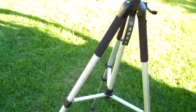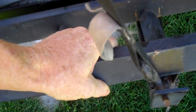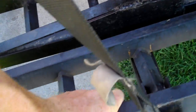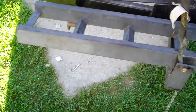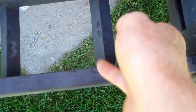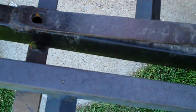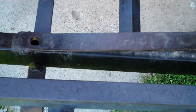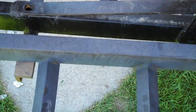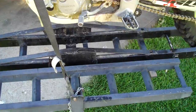We'll take the ramp — the ramp just stores up here. This is something that somebody else designed and had made in China, really crappily built. So what I did is I bought one for about 60 bucks, took my welder and just welded the crap out of it, took all the bolts out to save on weight, and just welded everything. You don't need bolts if you're welded, and the weld is way less than the bolts. It makes the whole thing not rattle and makes it all worthwhile.